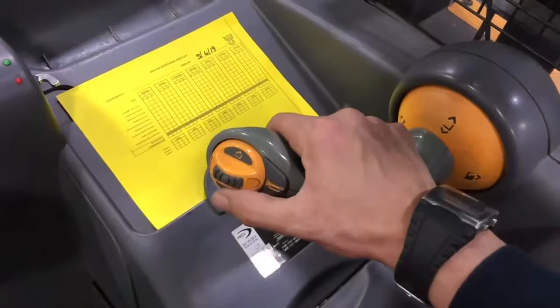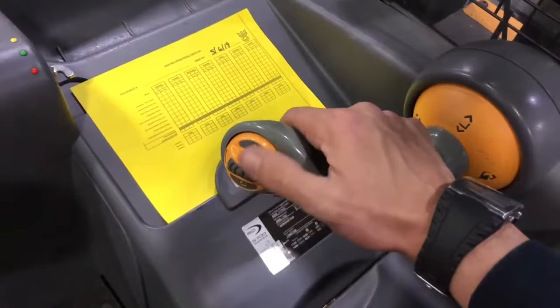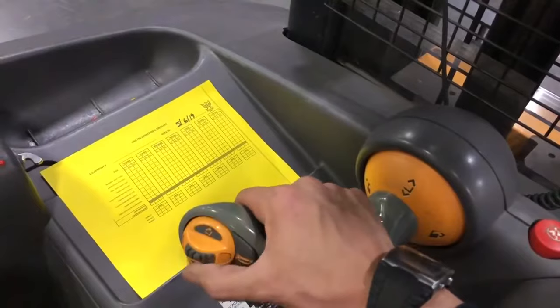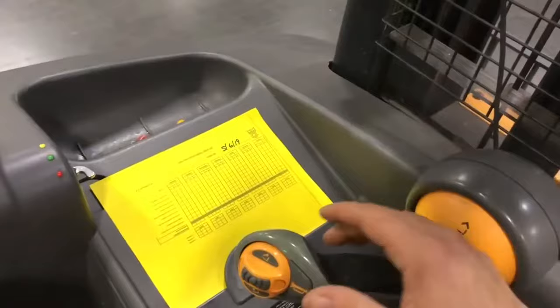There's a little photo showing that going up and down on this thumbstick is how I tilt my forks forward or tilt my forks down if I need to adjust in the air. Also, to stick my forks out and reach outwards or bring my forks back in, all I have to do is, with my thumb, rotate this knob forward — that will bring the forks out — or bring it back towards me, which brings my forks all the way back into the truck.